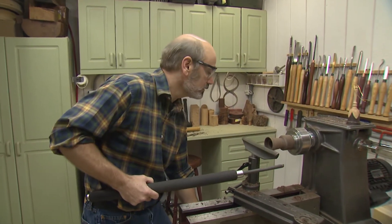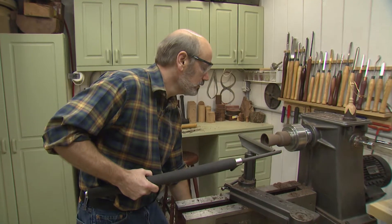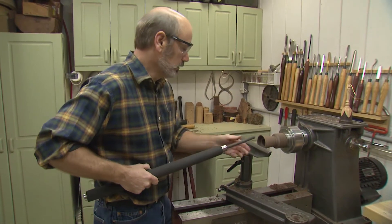I'm going to pick the speed back up on the lathe. The tool you rotate about 45 degrees — watch the contact here. Those are beautiful, beautiful shavings. You come back, take it a little bit more.